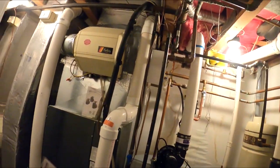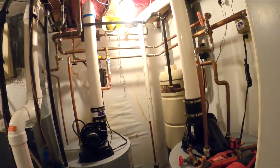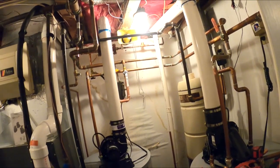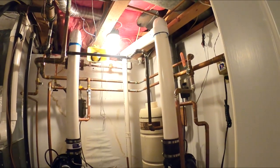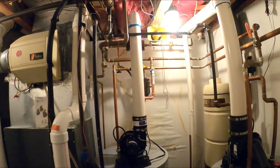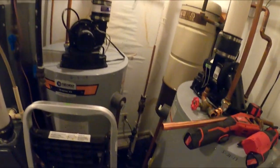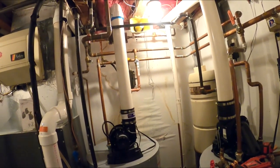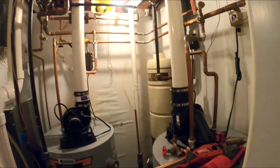I just got to get the aquastat put on there. I'm good. This video's getting long, so we're going to call it right here. All I got to do is that strap-on aquastat, plug the pump in, done. So at least I got water back onto this house. All right, guys. Sorry about the long video, but sometimes that's what it takes. These 12 volt pro presses, man, if I had 18 volt I wouldn't be able to get in there. It's a little slower, but it works. See you on the next one.